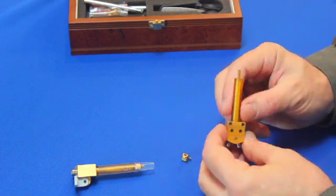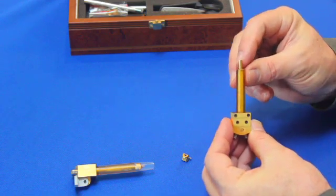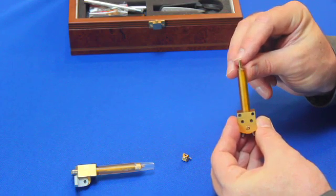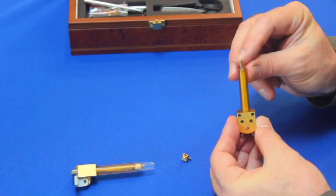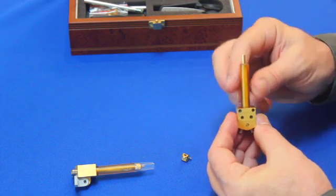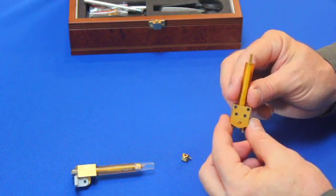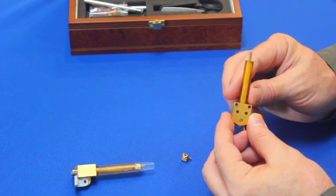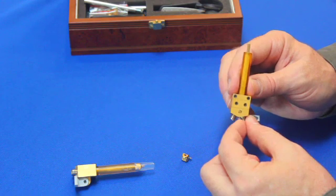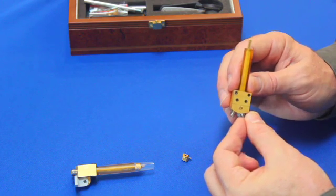In the most basic mode, without the ground collar, the probe has 100 ohms between the two signal pins you see here. If I short one of the pins to the outer shield and put a ground cap on it, then you have a 50 ohm probe. The probe has approximately 4.5 picoseconds of loss and a 40 gigahertz bandwidth, which includes insertion return loss.